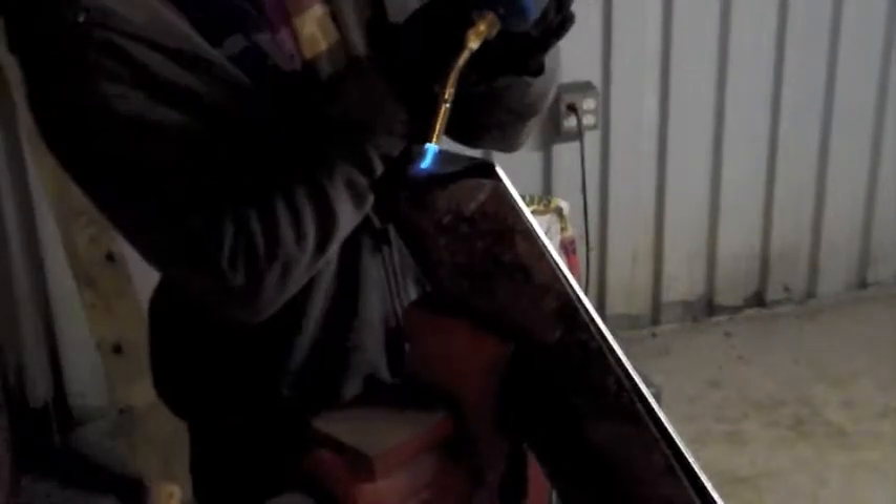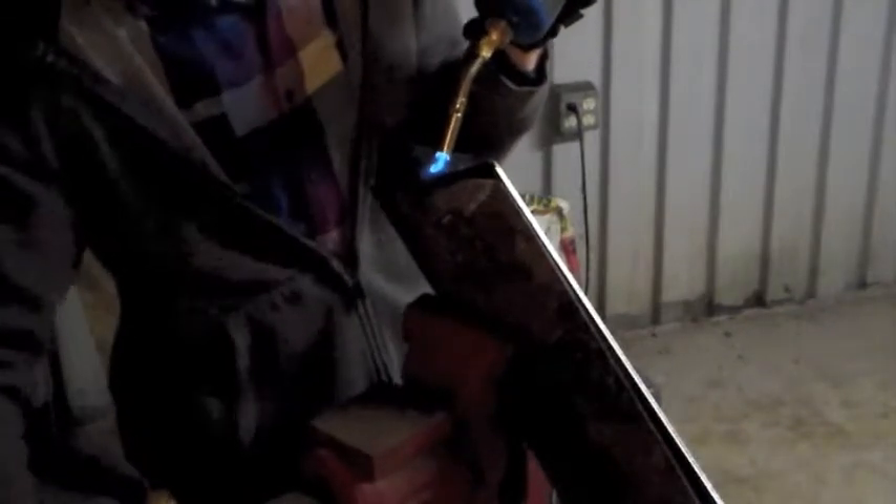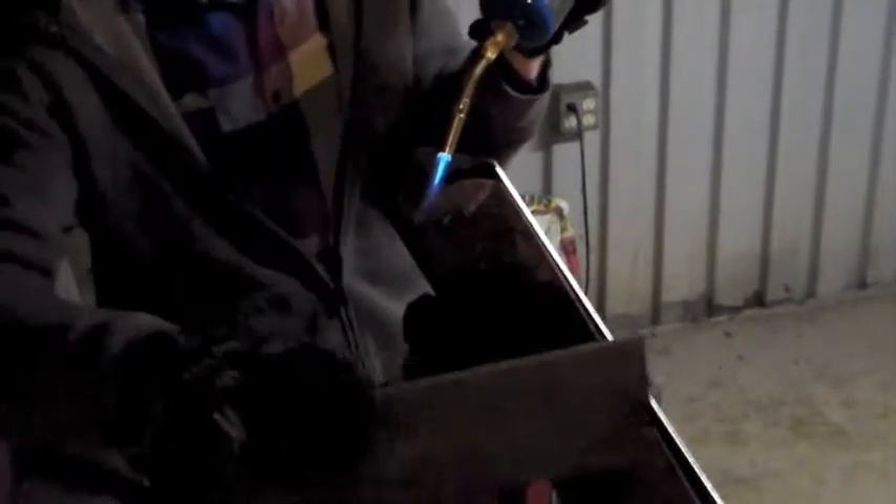You can see that the new piece doesn't match up exactly with the original. I think the original probably wasn't a perfect rectangle after all, so we are going to have a slightly different edge here. But that's fine because we're also replacing the land side — we're going to use another piece of new steel for that. So as long as we get that angle cut correctly, the two edges should match up.